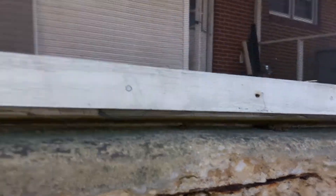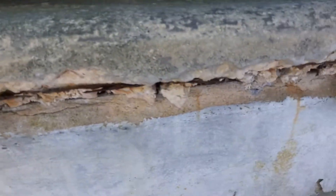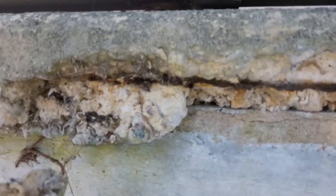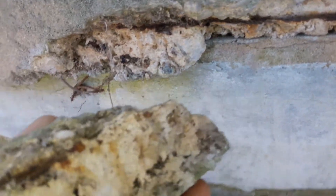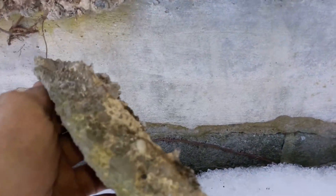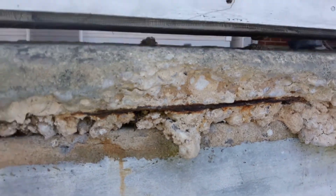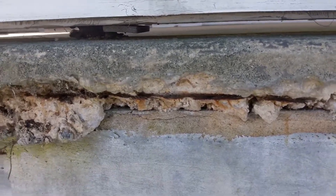It had a little bit of overhang, so you'd think water wouldn't get to it — but water did. This is what the crack would look like if you were just looking at a crack on the side of your porch and trying to evaluate why. That simple reinforcement caused the crack — there's the crack going across the top and back side of it. It's a good inch thick cover, but it's placed in the middle of that ledge, which is probably the most useless place you can put it.